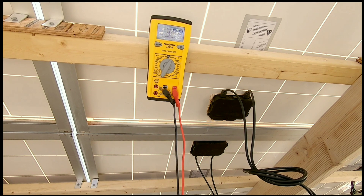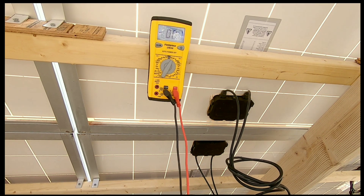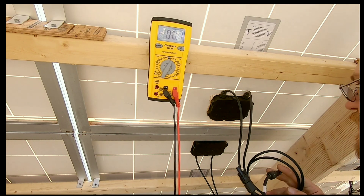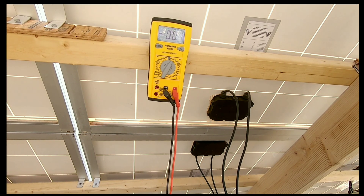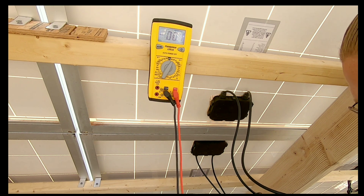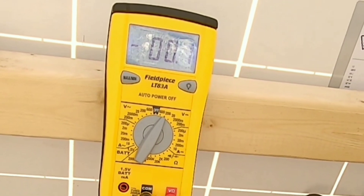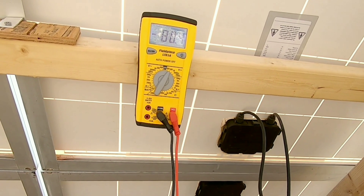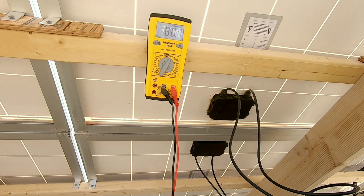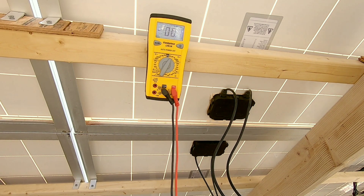I thought these were 24-volt panels, but these are not 24-volt panels — well, this changes everything. So I can only run two in series. Running two in series here, we're at 80.4 volts. That's what I have to do — run them like that — because I'm using a 48-volt system, and I'm pretty sure my MPPT controller is not going to support over 100 volts input for a 48-volt system. So I may change this configuration come winter.